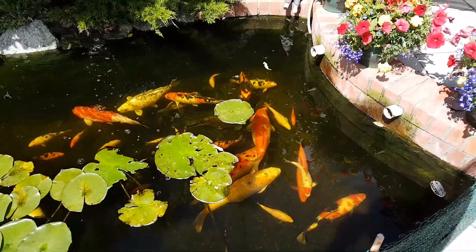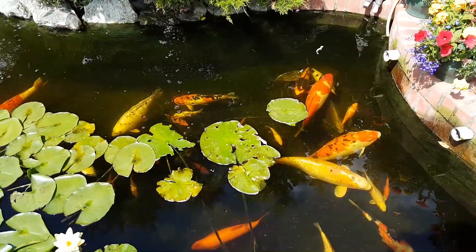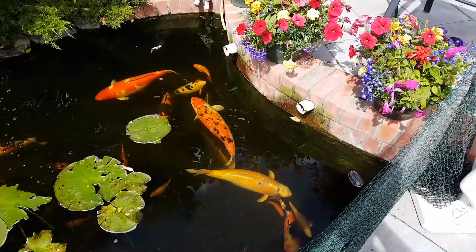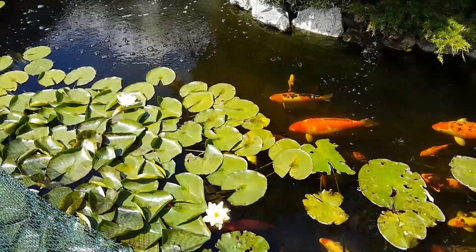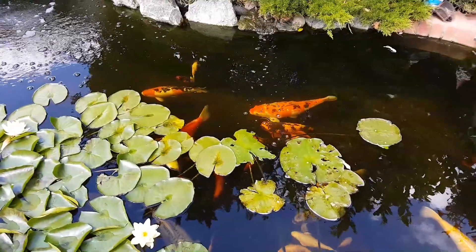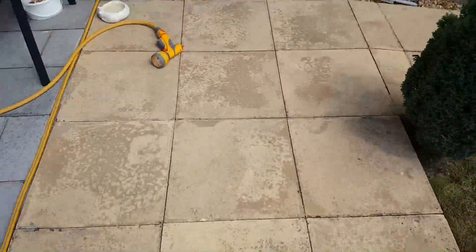Right guys, what I'm doing here is I've switched the pump off to the pond, so I can't hang about too long. I'm losing flow somewhere along the line and I'm not quite sure where. I thought it might have been the bottom drain, but I've actually opened the winter running valve which takes water from the top of the pond and it made no difference, so now I've got to have a look at the pump.